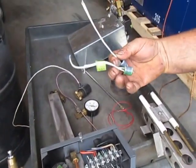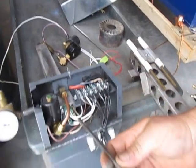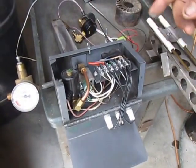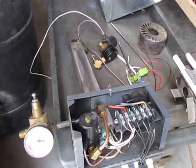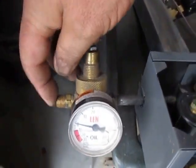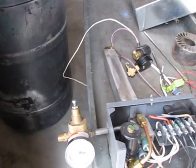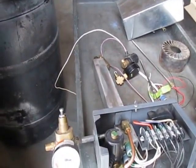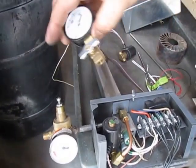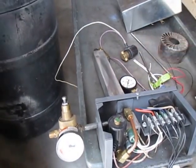You have two switches — one green for 160 degrees and one for 140 degrees. The 140-degree lower one is on the idle circuit; this heater slides into the block right there. If you have a J-pump — the round pump about four inches around with eight bolts on the end — that's a pressure pump. It uses a pressure regulator to control pressure to run the oil through the nozzle, and that's how you set your flame size with a J-pump.